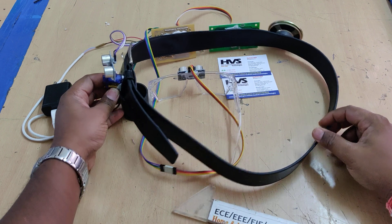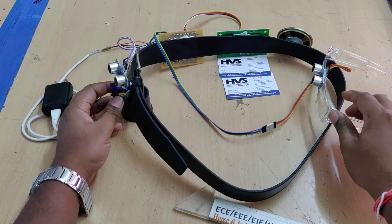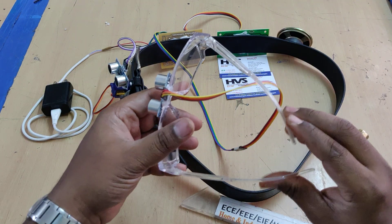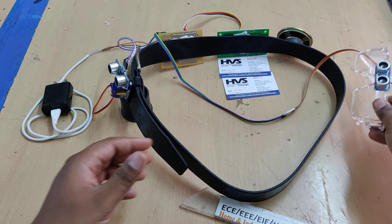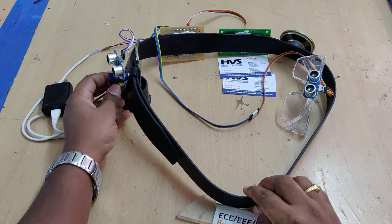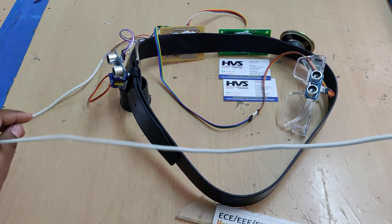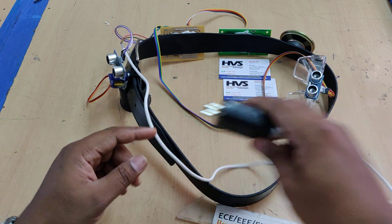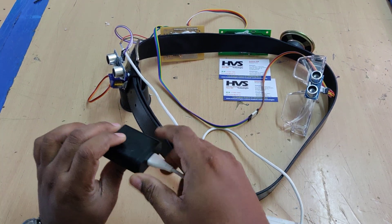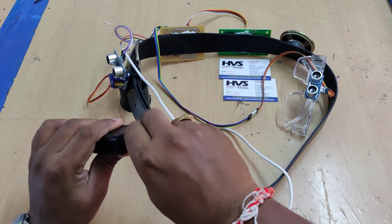For real-time demonstration, we mount the waist-level module on the waist and the spectacle module at the head level. We set the obstacle detection limit to 30 centimeters for demonstration — when the obstacle is closer than 30 centimeters, the respective voice is automatically announced. The system is powered on, and in real time we can use a power bank directly, so no 80–230V AC input is needed. For this demonstration we are using an adapter, but in real time we can simply connect the USB to a power bank.